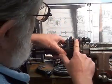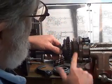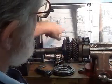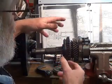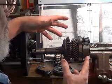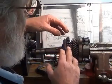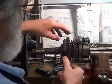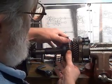It's turning — spinning freely. The reason it's spinning freely is because it requires this slider hub to connect it to the clutch hub. There are a few different slang names — different companies have their own terminology — but we're going to call it the clutch hub or the slider hub because it slides back and forth.